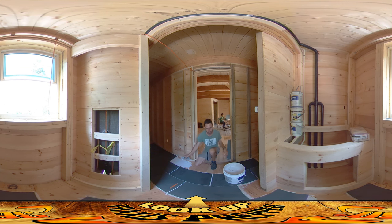The second thing I did was lay out with pencil on the floor where I wanted the tiles. When I was making that decision, I made it consciously. A lot of times almost every time I've seen a professional job, the tile layers essentially just start where it's convenient — probably that back corner over there. I didn't want to do that. I wanted a full tile laid right in front of the doorway, so I started with that and laid everything out from there.